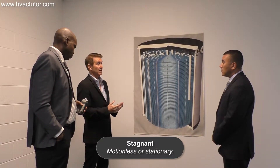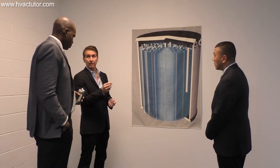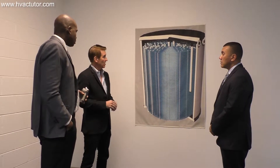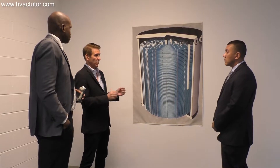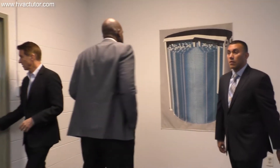So we designed it so we don't have a lot of stagnant water. We're only making about a half inch of ice within the tank from each surface of the tube. So the tube material — you could make this out of copper — it would not perform any better once you've got that first quarter inch or eighth inch of ice on there. Come on out, we'll take a look.